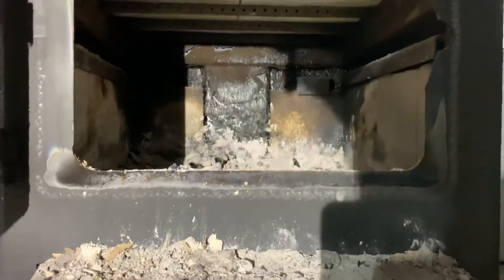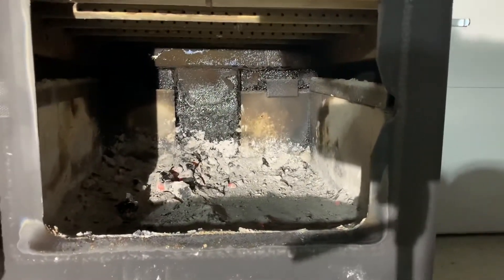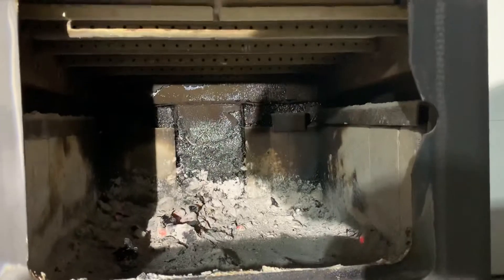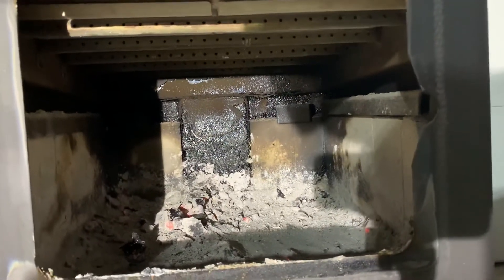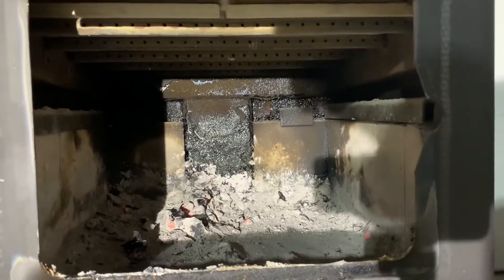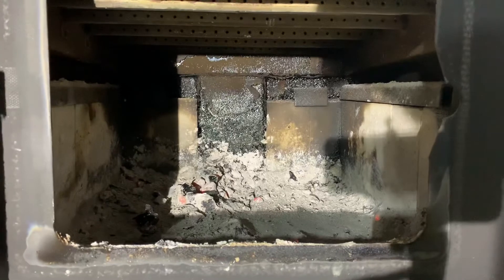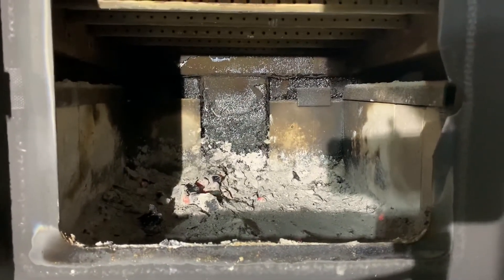I think that's all the measurements that really count. They say don't go above the fire brick when stacking, but I stack it all the way up to the re-burn tubes up top and don't have any problems. It depends on how good your draft is — whether it'll go into an overburn situation or not. That firebox is big enough for me.